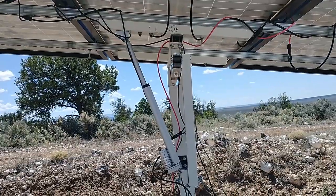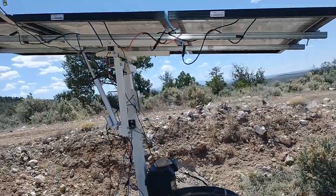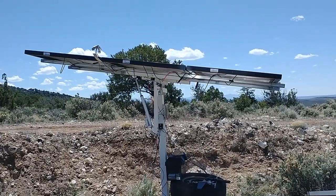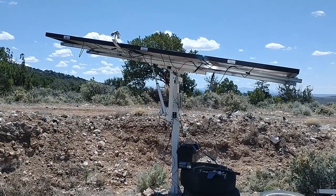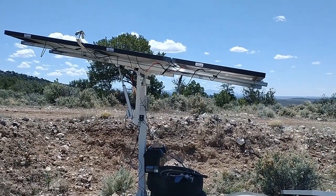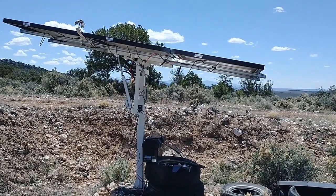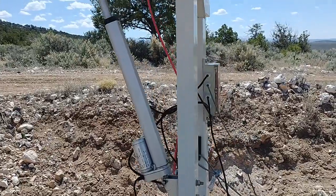As it turns out, that is roughly where the linear actuator was when it failed. I'm thinking this is about the angle it was setting itself flat at — it wasn't getting quite flat, and this was sort of common. I think it broke while it was set flat, so just the oscillation must have been enough. That was probably a cumulative thing where those bolts were fatiguing and over time they eventually snapped. I've got much stronger, non-Chinese-made grade 8 bolts in there now, so hopefully that will also help.